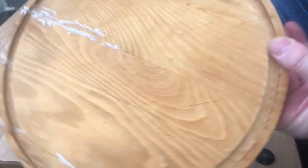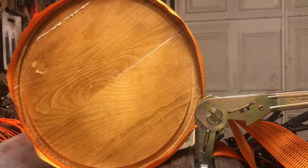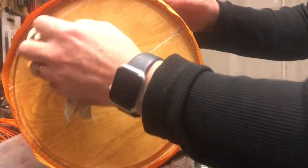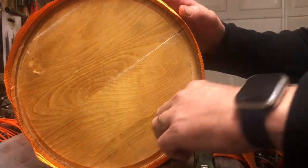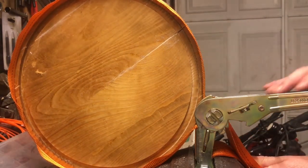I've spent quite a bit of time working the wood glue into all the crevices. We're going to give it a quick wipe down — I've even filled a few of the smaller gaps, just to see what happens. I did it both sides. We're going to cramp everything up and see how much glue squishes out. The squishing has started, so I've got an old cloth to remove the excess glue as we go. I've got it nice and even. You've got to keep this central, which is a bit of a challenge, and also keep everything square on the ratchet strap side of things and hold the board upright — there's a lot going on.